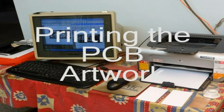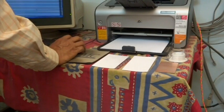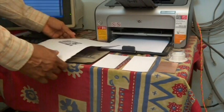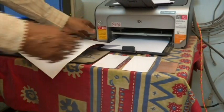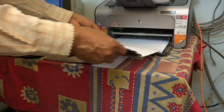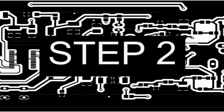The first step is to print the PCB artwork onto standard photo paper. The artwork should be at 1:1 scale with the top mirrored. To economize on photo paper, we start with two pieces slightly larger than the PCB. We first print on A4 size paper in draft mode, then fix the photo paper with the shiny side up onto the draft print using 3M tape, and repeat the print in final mode. This gives us prints of the top and bottom layer on A4 paper and photo paper.